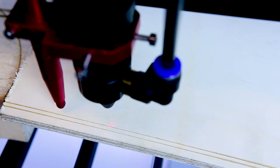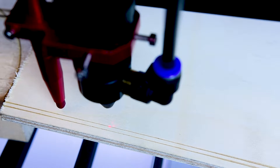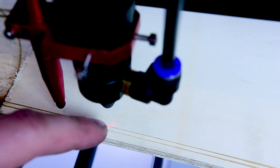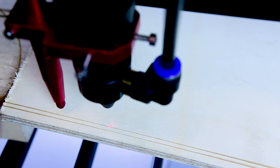This is where it may become more apparent why I wanted to spend the money on the red dot — it was only 50 US dollars and now I have a red dot exactly where the laser beam has hit. So for doing things like lining up pieces of work, this is just awesome. What we've done with this focus ramp is create basically a profile of the beam. I'm trying to figure out where the narrowest point is so we can measure where the focus is going to be. I've got that set where I think it's pretty much the narrowest point, and we'll get that measured with the calipers — almost bang on 17mm.